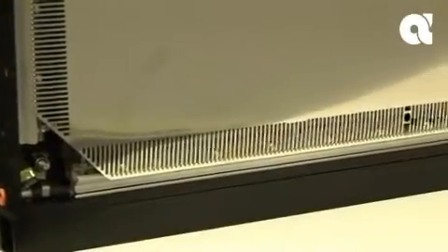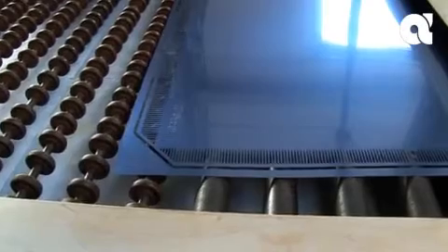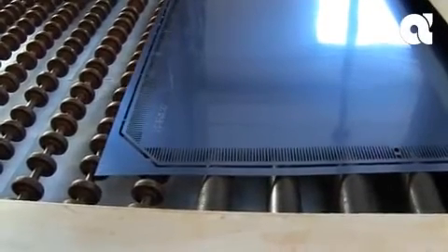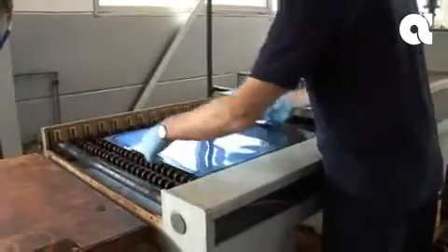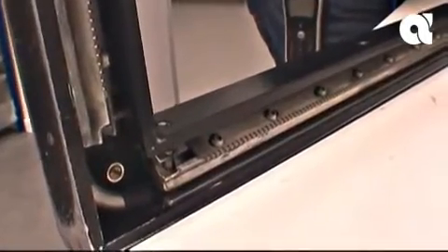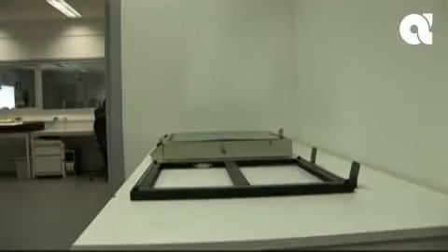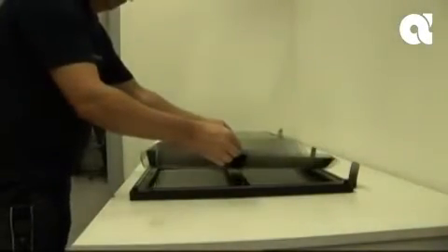However, these foils had four potential drawbacks. The engagement slots need to be pre-etched, introducing a further wet process stage in the manufacture of the laser-cut option. Foils are not rigid in their pre-tension state, making them susceptible to damage when handling and mounting. The tension is not distributed across the foil as evenly as with the original mesh-mounted stencils. And lastly, the naked edge of the foil is perceived by some to be a potential health and safety concern.